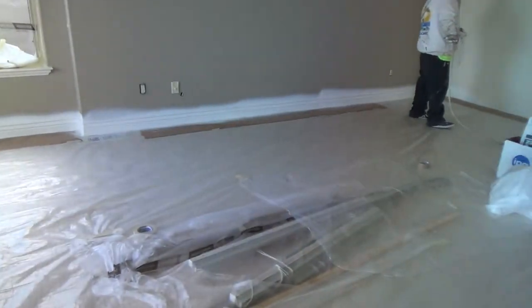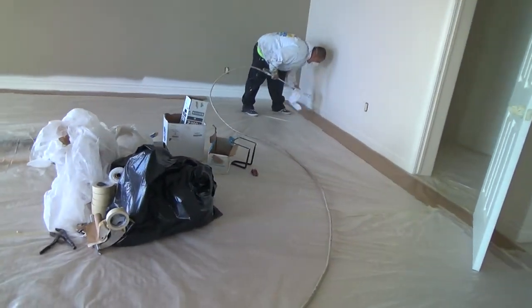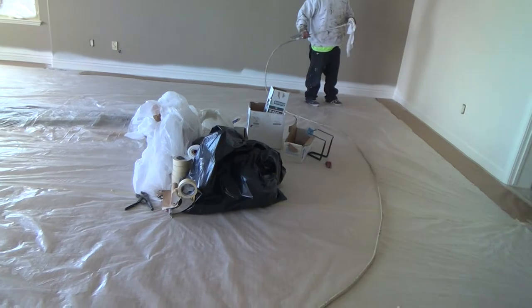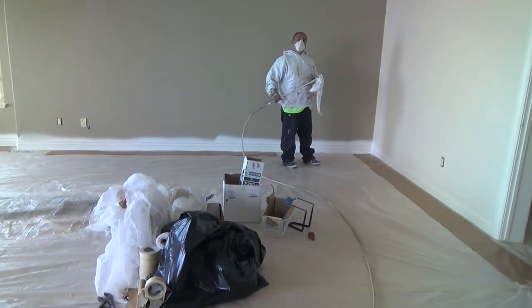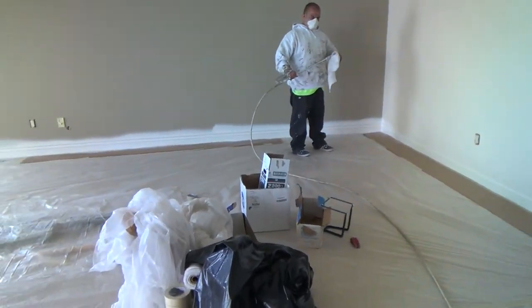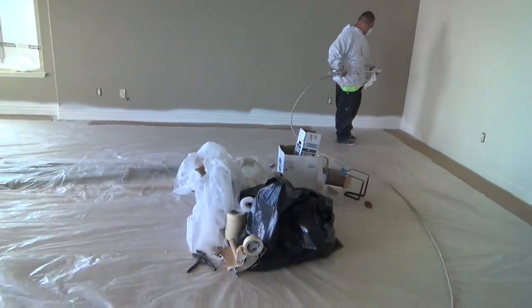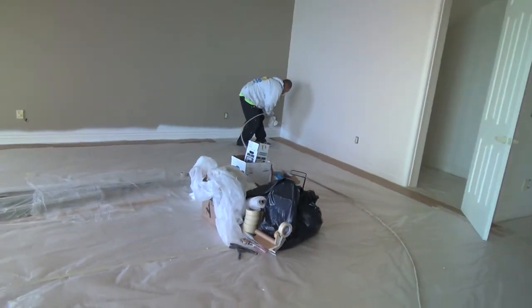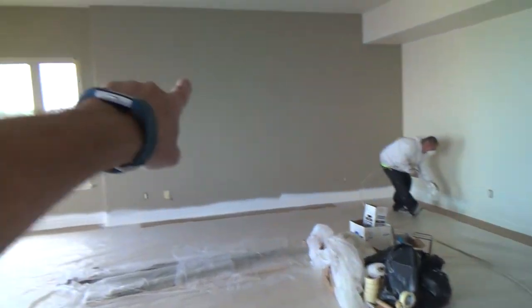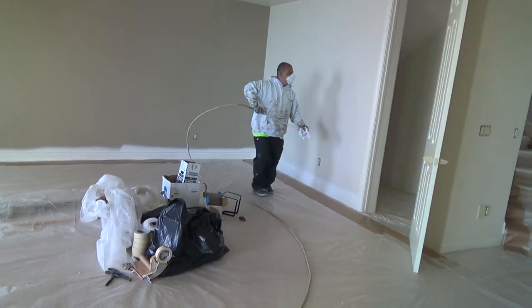Even on a dark colored wall — when he paints the dark colored wall, you probably have to put a quick thin coat first to cover up the white before you do the full body coat. Then they get another two coats on the wall. You're going to put two coats of finish on all the walls — the white ones as well? Yes, sir. And I wouldn't have thought that either. If I was painting with a roller, I'd put one coat. They're doing full bore — two coats of finished paint.